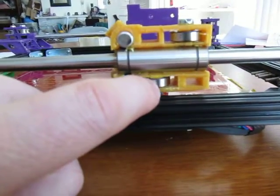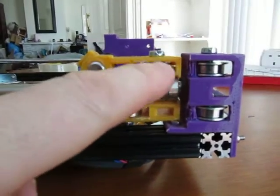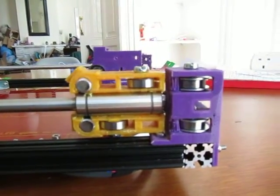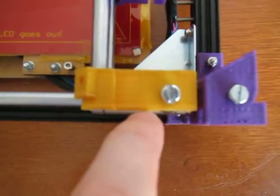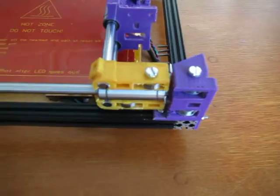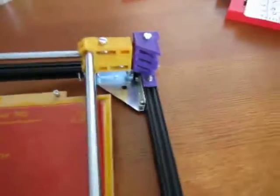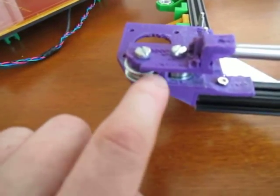This is a vertical arrangement for the bars and I have deliberately offset the bearings. This is a Core XY design with one belt going above and one belt going below. One of the critical things — and you won't believe the number of people who get this wrong — is that this bearing here must be absolutely dead level with that one and go that way, and likewise the other one dead level and at right angles to the bearing there. I'll be putting a twist in the belt so that it goes back-to-back on the idler bearings rather than using toothed bearings as some people do.